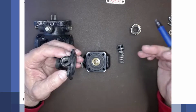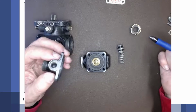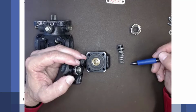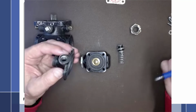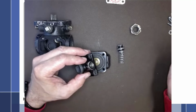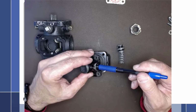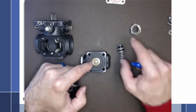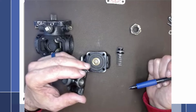As the turbocharger or supercharger spools up, it is going to create more pressure in the upper deck, which eventually leads to more pressure inside of the manifold going to the engine. As that pressure builds up, we're going to want more pressure out of the pump to the fuel control unit. So the turbocharger spools up, puts turbocharger pressure inside of here, which presses down on this diaphragm, which assists the spring, which increases the outlet pressure of the pump.